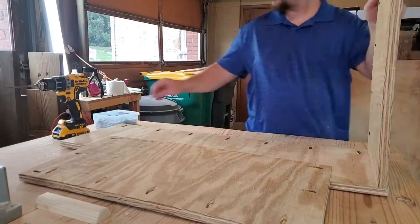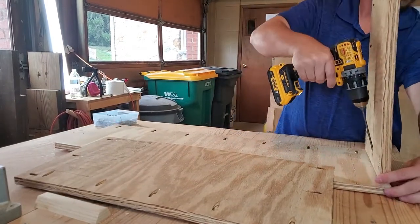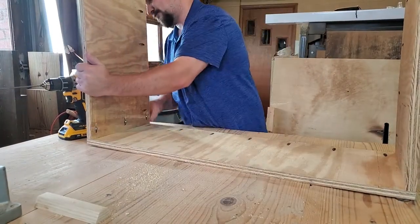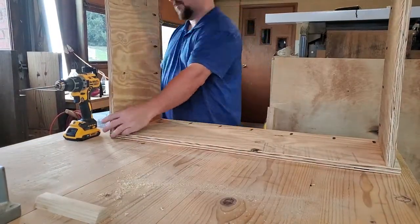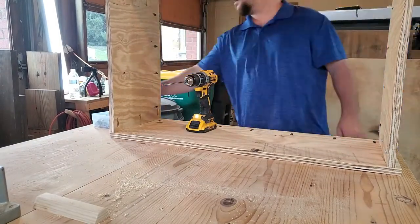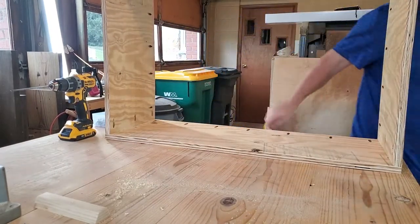When working with pocket hole screws, they tend to make your piece slide away from the pocket side and misalign your alignment just a little bit. I've found a way to compensate for that and get it to land where I want it to most of the time. They do make some handy clamps that will take care of that if you're working with a tight tolerance. Do you even feel a sense of accomplishment if you don't give your piece a little slap after you're done doing something?